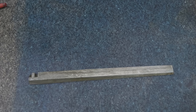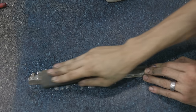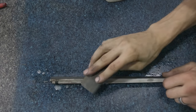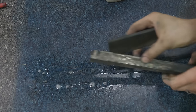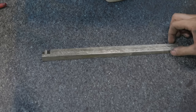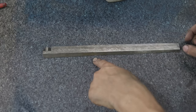With the top two pieces fitting well it's time to move on to the gib. Anytime you're scraping a gib, make sure you stone the area where the gib adjuster screw is — that area can have a raised burr. I'm spending a little more time stoning this because I want to see how it hinges. Hinging is a technique we haven't talked much about: it can be used on any part you're scraping but gives you a general idea of where the highs and lows are. On a gib it's really quick and it also shows if you're bowed, which is very likely. As far as where you want to be hinging, about 30 percent from each end is recommended — hinging in the middle shows where your high spot is.